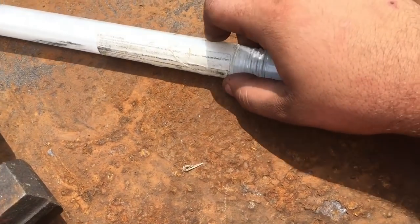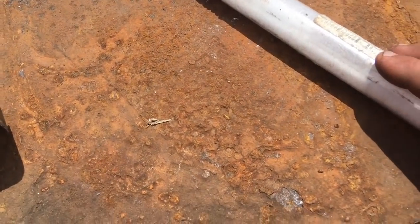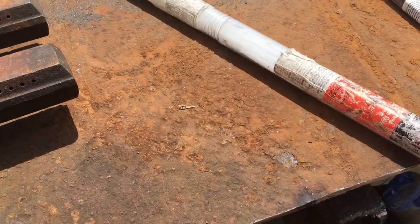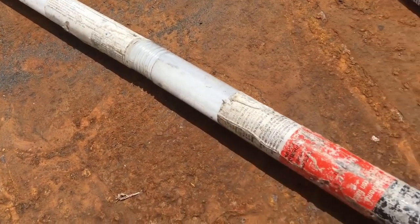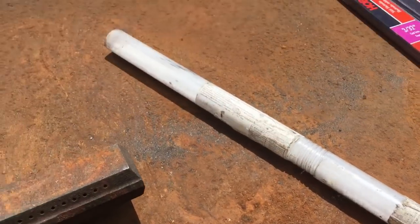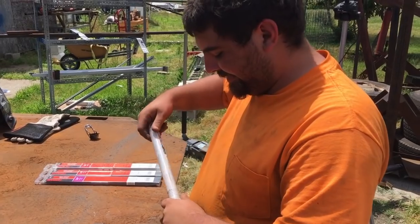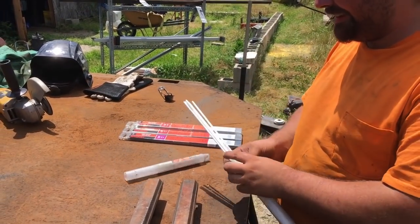This is kind of my go-to for most cast iron because of how simple it is. These are brazing rods you use with the oxyacetylene torch. They're flux-coated rods. They're cheap at Tractor Supply, Northern Tool, or wherever you go to get such things. You can see I've had this forever. It's worn out. Can you hold this, Noah, while I try to open this thing? What's left of it? And the flux goes everywhere. Good thing they're not stick electrodes.